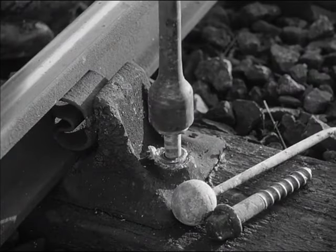Here is a rail joint in bad condition. The fishing tables of the rails are worn. If you look downwards onto the joint and compare it with a straight edge, you can see the wear at the centre where the fish plate appears pulled in. The cure for worn joints is to use tapered shims. These are placed in pairs between the rail and the fish plate. They are thicker at the inner or joint ends. Their job is to take up the wear of fish plate and rail, thus raising the running surface of the rails until they are level once more. Bob takes a look at the joint along the rail from some distance away to get an idea of the amount of wear.